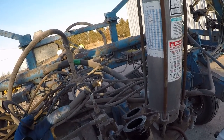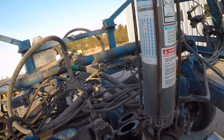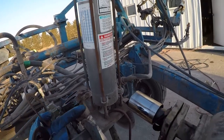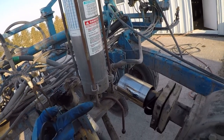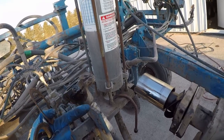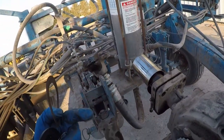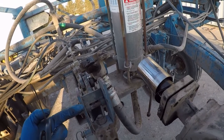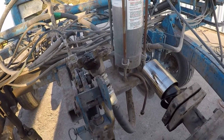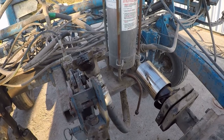Getting the thing primed and bled off is a real pain. When I finished last night I opened all the bleeders and probably sat there for half an hour until it stopped actively bleeding liquid, but it probably took another hour or two to get the vapor out. You want to make sure it's bled off well so you don't get super cold liquid on your hand and freeze burns taking things apart, and also the inhalation hazard. So I let it sit with all the bleeders open overnight - and I still spilled a little ammonia in a couple spots taking the pump apart. That's why I ran based on the experimental rate yesterday rather than repriming from scratch.